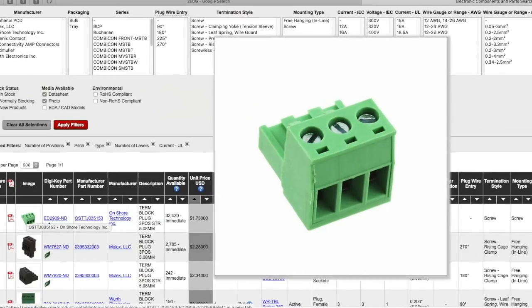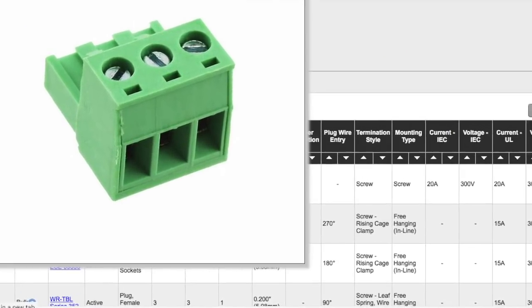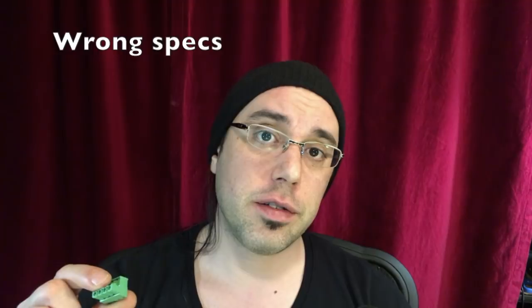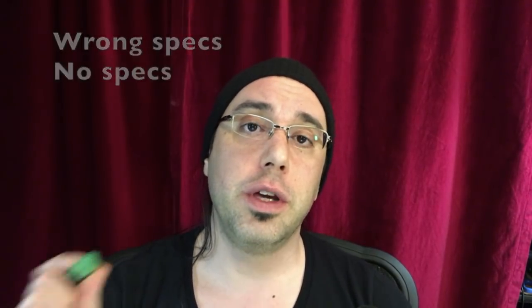These are fairly cheap. If you happen to buy a RAMPS board that has an unmarked connector or one that's rated a bit too low for your heated bed, you can just go to Mouser, Digikey, Arrow, RS, whatever, and find one that has a sufficient current rating. What exactly is going on with these that makes them fail? The biggest problem is that they just heat up and melt down or catch fire — obviously not desirable. That falls into three categories: the manufacturer could be lying about its specs, it could be unspecced, or it could be user error.